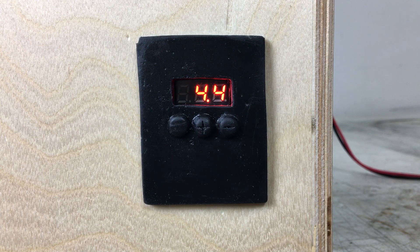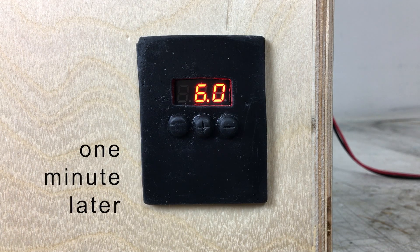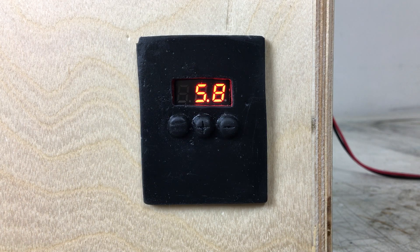Now we'll go back to showing the temperature at the probe. I've set five degrees Celsius as the target temperature with one degree of hysteresis and a one minute delay. As you can see we're already below five degrees Celsius but it will keep cooling down for another degree until it reaches four degrees Celsius, and then it turns off at four. To speed things up I'm going to put my hand on the probe to heat it up. Now even though we're way above five degrees it won't turn on until its one minute delay has run out — it's cooling down on its own because I took my hand away but you can hear the fan has not turned on. After one minute it kicks on again because it's still above five Celsius, and it will keep cooling until it reaches four Celsius.